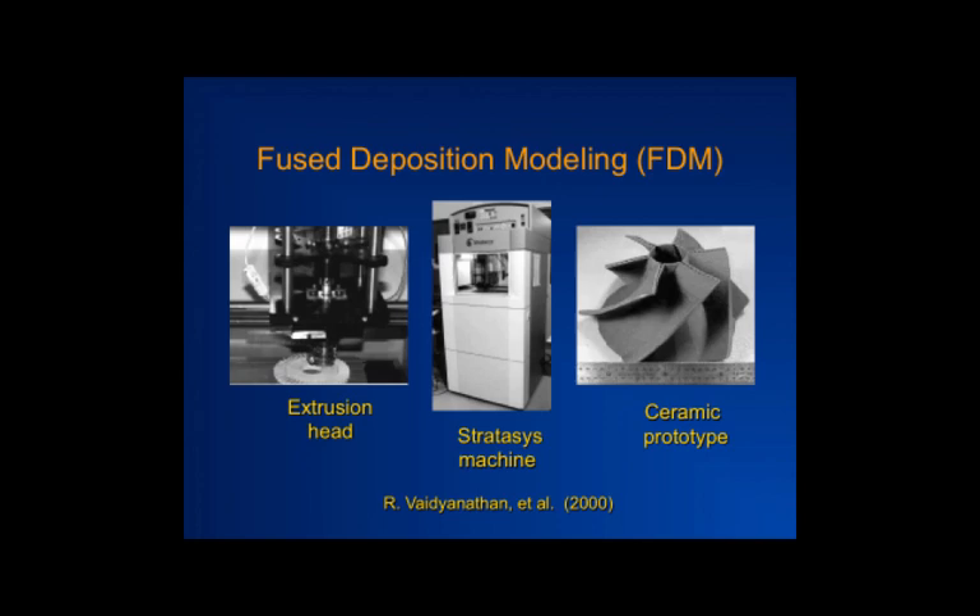After printing you still have to burn out the polymer and fuse the particles together by sintering. But if there is too much of a density gradient between one filament and another, and the weld is not strong enough, sintering will not cure it properly. All layer-by-layer processes share this weakness. You can make good prototypes, but getting to full structural parts remains a challenge. These are all examples of creating parts of varying complexity using a polymer melt combined with powders.